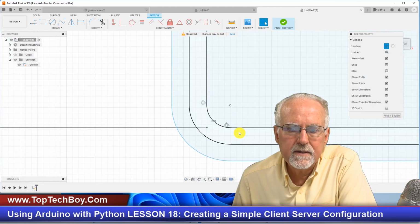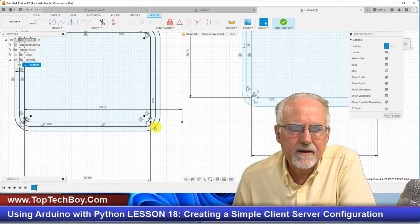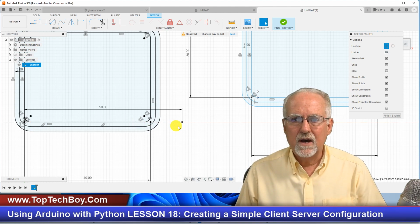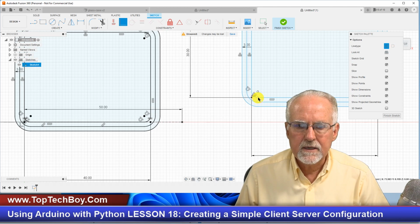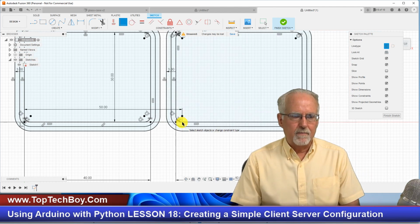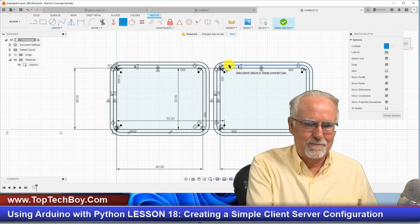And it looks like I could take that point. And then if I took that point and constrained it to this point, everything would be locked down and these would be equally horizontally aligned. So I'm going to click off, get my coincident constraint, select this point and say that I want it coincident with that point, and boom, I got it. I'm always a little nervous when I put those constraints in there because they don't always do exactly what I was expecting.